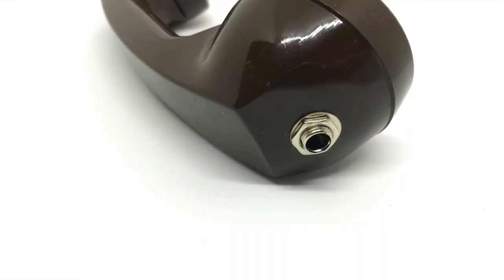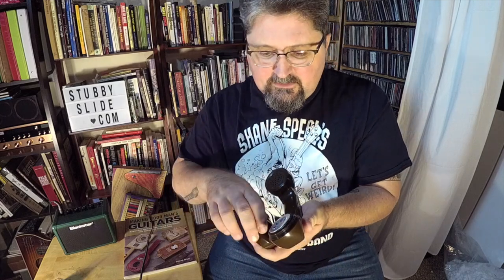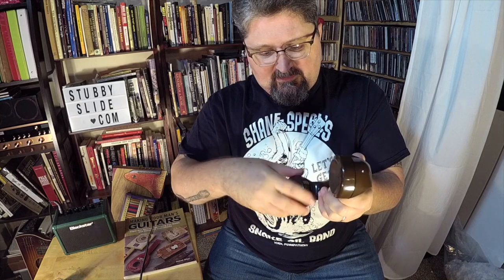The only other thing I did was I took a little drill bit and drilled out the hole that the phone jack used to be in there. I drilled it out just enough that the guitar jack could fit right there. That's it. I put this back on. So you're actually talking into the earpiece. You could probably unscrew this, and if you want to take the earpiece out and move it down, you could do that. But if you want to do a five-minute project, all you do is cut the wires for the earpiece, put those two wires to a guitar jack, and you have an incredible microphone.